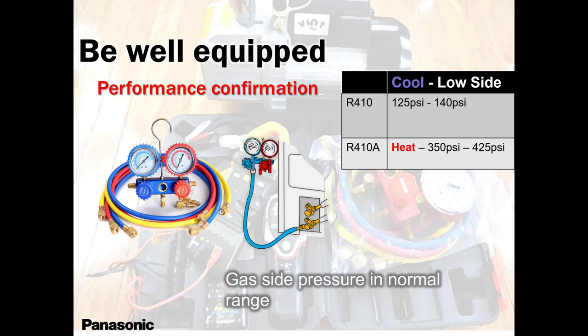If the customer is saying it goes into defrost cycle every 20 minutes, that's not true. Because our system is programmed, every 50 minutes to be precise, the system goes into defrost. And you will not get another defrost cycle for the next 50 minutes. So if the homeowner is saying that they're getting two defrost cycles in less than 50 minutes, don't tell them it's not true. They're going to get upset with you. But you can tell them that's not what the system has been programmed for. So what I'm going to do is spend 50 minutes here to see how long this system is going to go into defrost and how many times.